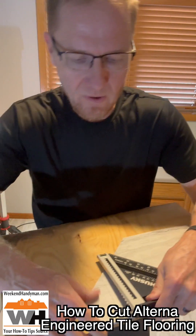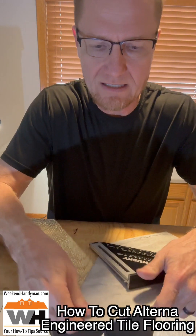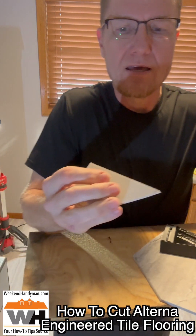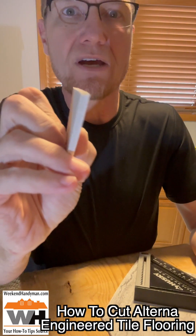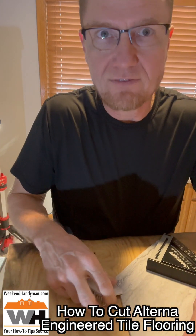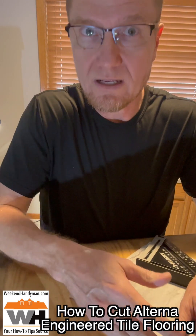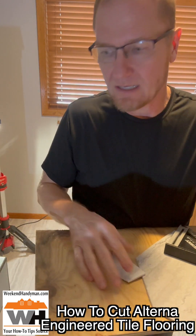Once I've pulled through about 20 times, give or take, it will break like that. I went a little farther with typical cuts, but I have a nice straight cut now just using a straight edge and doing that. It was just that slow, letting the knife with minimal pressure score it, and then getting to the point where I was starting to feel it kind of grabbing on the vinyl. That's the magic of cutting this — it's not hard to cut.